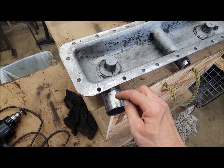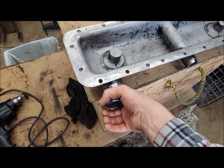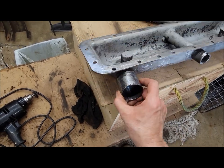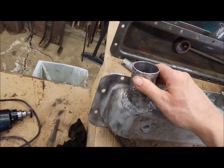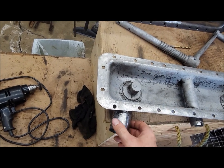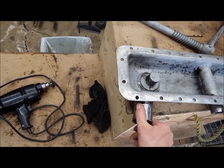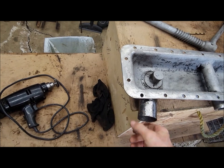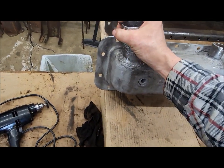There was some rotten spots where the old hose was, and between that and the moisture I suppose got in there and rusted out. There were some spots that were actually holes right through. I welded them up, ground them smooth, and I even welded up some of the pits to make it a little bit nicer. I'll probably do like I did on my 2035 short fender - those are cast tanks, I couldn't weld them up, they weren't rotten through but they were very pitted. So what I did was put a smear of JB Weld around there so it's a nice smooth surface for that new hose to seal up against. That worked pretty good, so I'll probably do something similar here just to make sure that hose seals up nicely on that pipe. I'm pretty confident that I have all the holes welded up so it'll actually hold water.